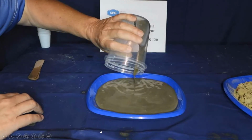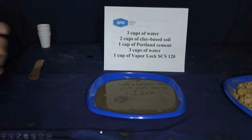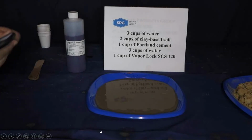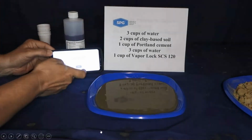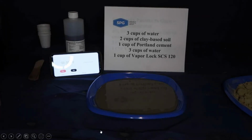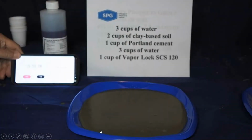And it's really a nice system because it's completely invisible to the soil contractor. And it brings all positivity to it. We're reducing the cement, putting in some VaporLock, increasing the compressive strength as shown by our extensive proctors, and increasing the tensile strength. Another great factor here is the difference in the cost of 2% of the Portland or lime kiln dust basically is the cost of what our SCS 120 would cost. So you're waterproofing your base at seriously no extra charge over your standard 6% stabilization.